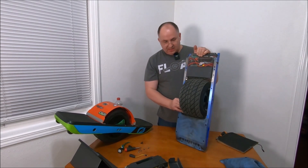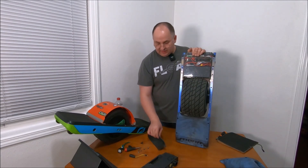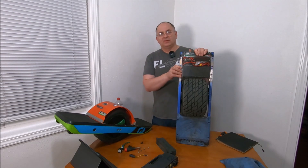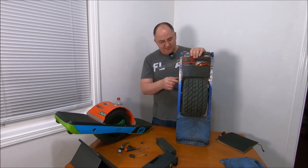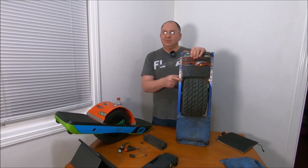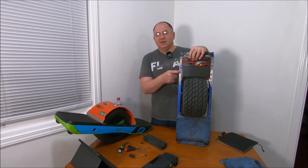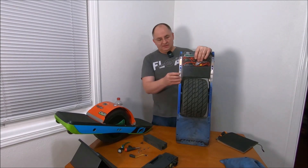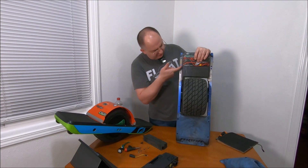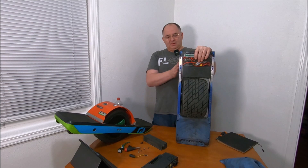About the welding part: the original rails were made for the original box, and there's a connector guard that fits into the frame. Most people who've taken apart an XR know those brackets fit into the frame itself. You have to weld them out and machine the inside to make sure the box will fit inside the rail. If you don't cut and weld them, the box will not fit. I recommend you machine it inside and weld it outside, because if you cut inside and then start welding, the welding process will shrink the aluminum and the rails will go out of shape.